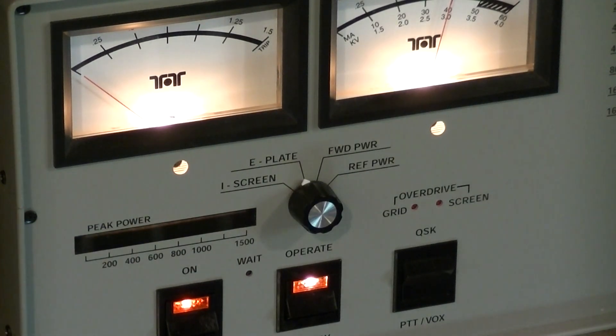This is a very cool-running amplifier. It will run 100% duty cycle at a thousand watts output — if you want to run RTTY, AM, or just key down with FM, it'll run continuous at a thousand watts output. I've seen idiots on the internet with these things on dummy loads run the output up to 2,500 watts. That's the beast of an amplifier; we don't run it above a thousand most of the time.